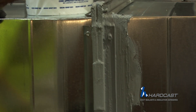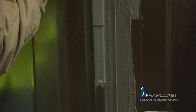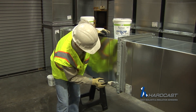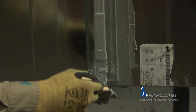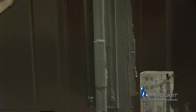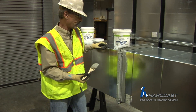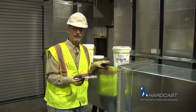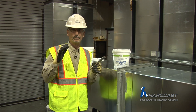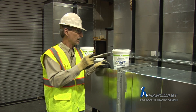I'm going over the cleat, getting into this critical joint right here. I'm going to work this mastic — get the bottom joint and just work my way up. We've got two cleats on this, and this happens to be a Nexus 4-bolt flange. Air is different than water: water is affected by gravity, but with air it's 360 degrees. So when this thing gets pressurized, you can get a leak up here or a leak down here — it's one big balloon. We're trying to make this ductwork into one seamless balloon.